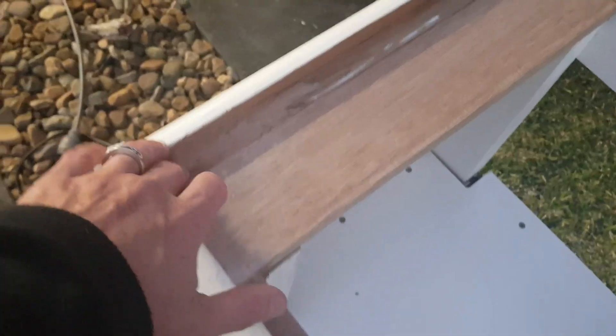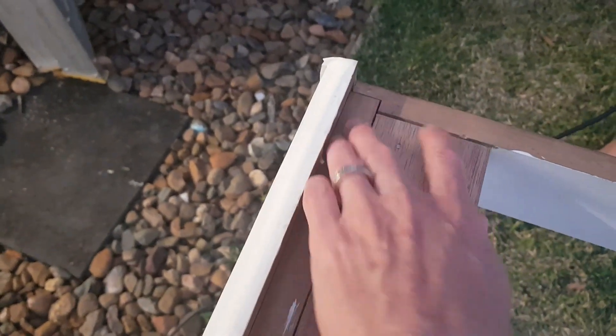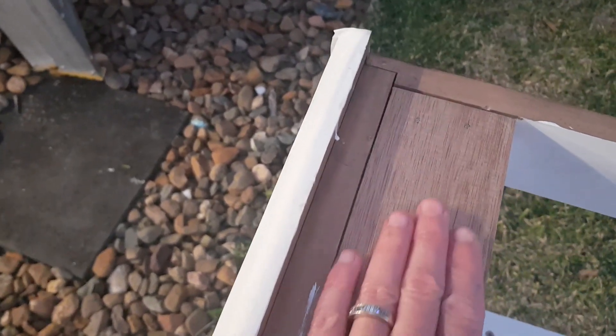It's dried out now but because it's quite cold weather it's taken quite a while. We're going to fill that up a little bit more and then we'll be done. This has all been dried out — it's been a couple of days. The issue we've got is this piece of wood here is just half a mil higher than the rest of the surround, so we're going to sand it down and get it nice and flat so that the whole frame is flat for the fish tank to sit on.